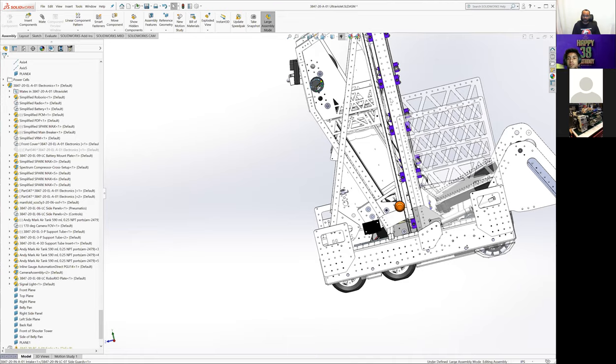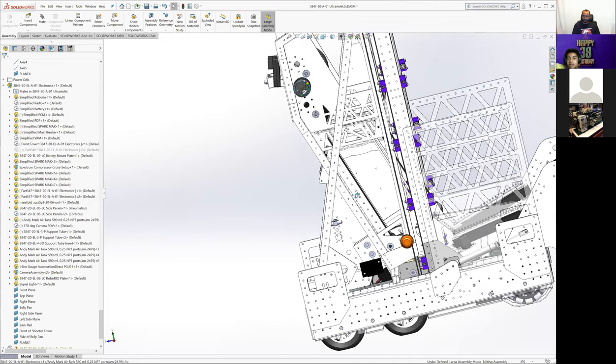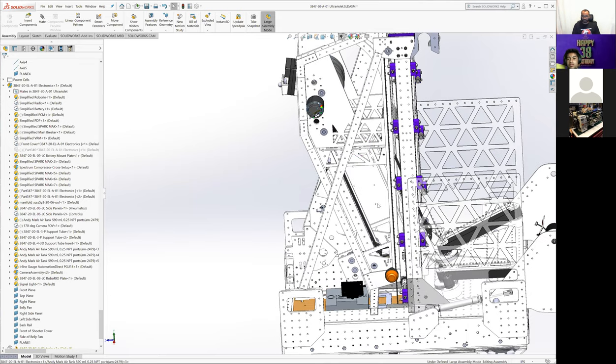Okay, so yeah, this gets pulled down and away. So now this gap up at the top is bigger, but the gap at the bottom is the same. So balls can kind of be pushed in, but as they go up, they slide back down because they lose compression between the two belts. So the goal was to basically be able to stack three balls much closer together than you normally would, even with just ball spacing, right? You normally end up leaving kind of a gap, and we were trying to fit three balls into a relatively short tower.